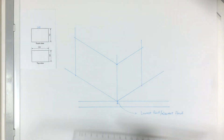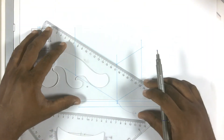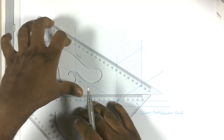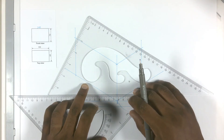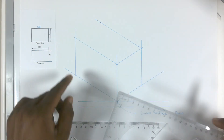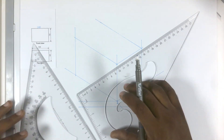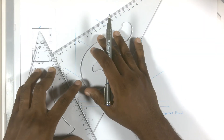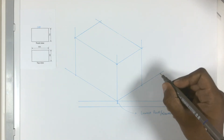So what is the solution? First, place your ruler on the line which you want to copy. We want to copy this line and do a similar line right there, so place your ruler on this line. Put the other ruler as a guide below, then slide the ruler until you get to your point and draw your line. Same thing for the other side — we need to make a line similar to this one. Place your ruler on the line you want to copy, use your 45 degree set square as a guide, then slide your ruler until you get to your point and draw your line.